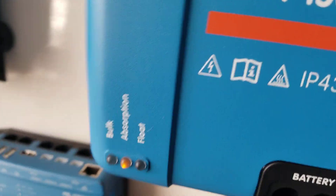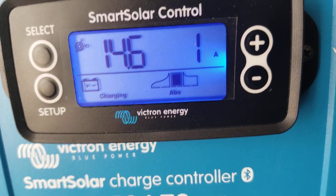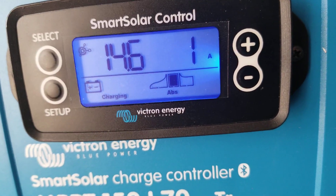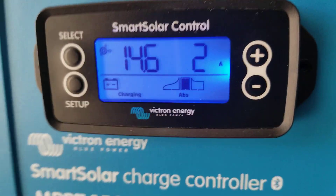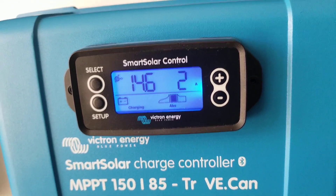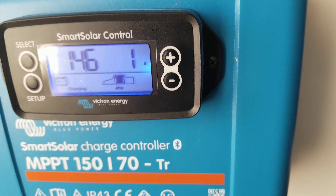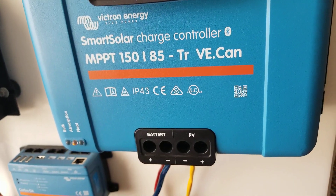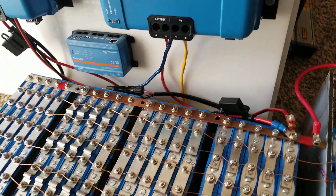The amps dropped — we went to absorb. You can see they're all in parallel, stacked together, and it jumped to absorb right away, dragging this one too. The parameter I set went to 14.7 volts while pressurizing the batteries, then it dropped to 14.65 volts for absorb — the Victron display doesn't show the decimal, so it shows 14.6. After absorb it's going to go to float. Anytime from now it'll go to float — you can see the lights. Stay tuned, like and subscribe.